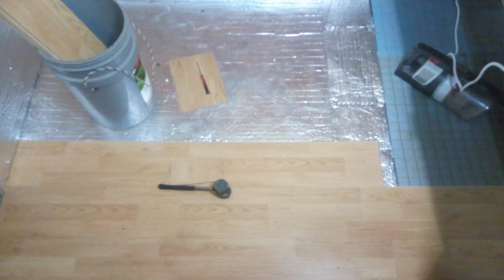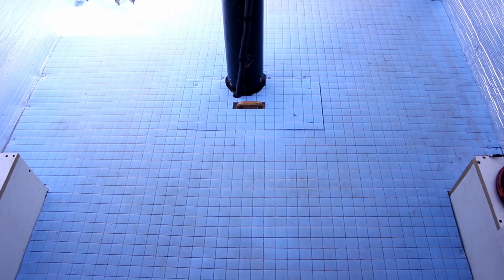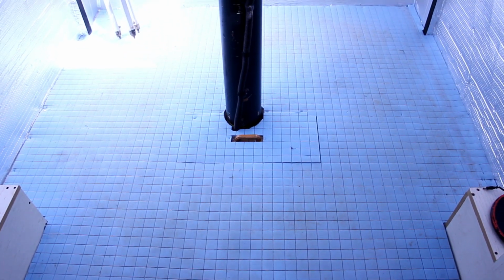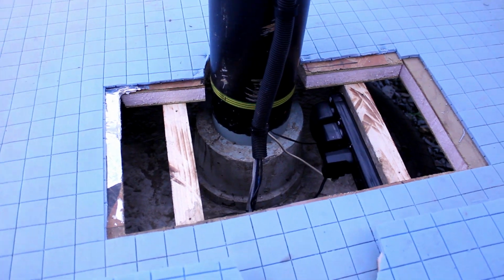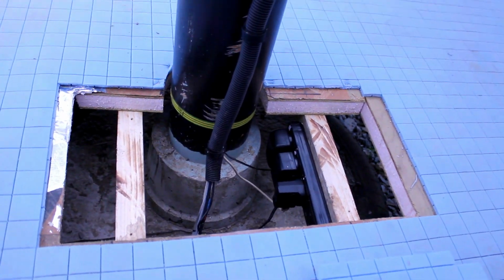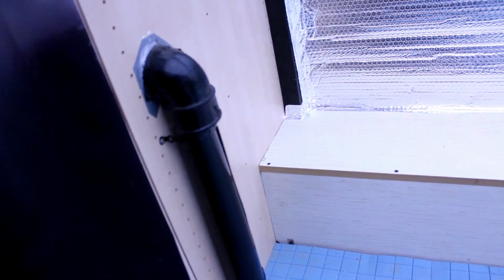So from this point on, it was just about all the finishing touches and padding it out, tarting it up. Starting with the laminate flooring. Out the observatory end, I put that blue underlay down. It's a nice padded thing to walk on, and it doesn't mind a bit of dirt. Into which I cut a flap that I can take out to help with wiring. Inside there's a 4-way adapter which powers some of the stuff on the mount, and the wiring from the pier runs underneath and back up through this pipe. I had to do it that way because I'd already put the laminate down before wiring, and I didn't fancy cutting a hole down through that.